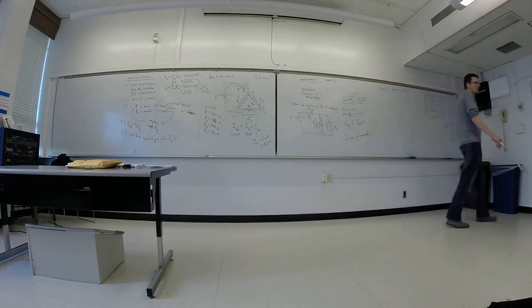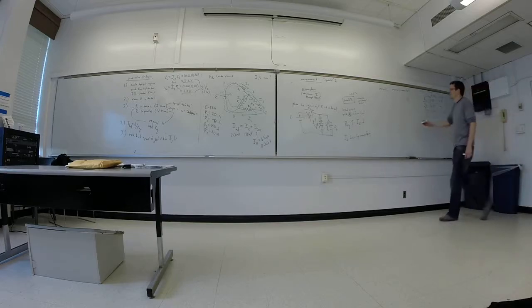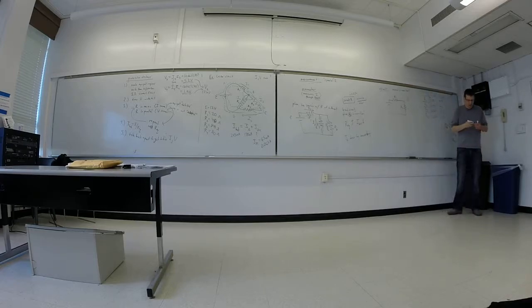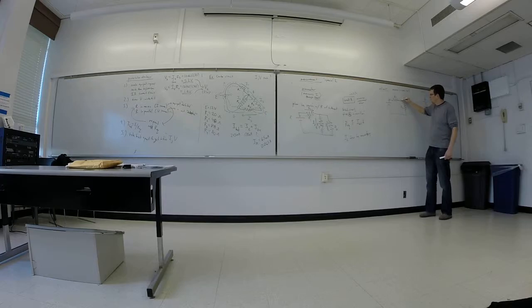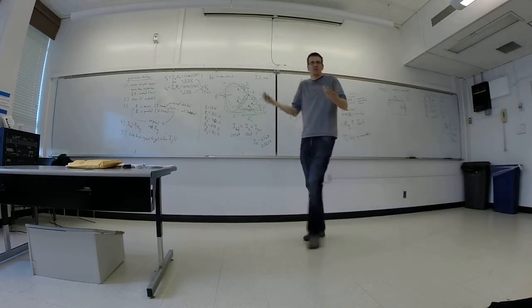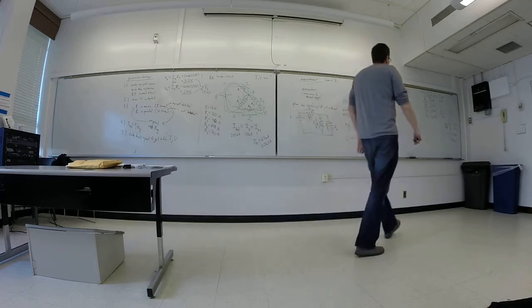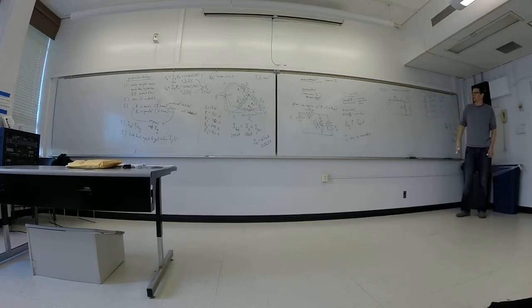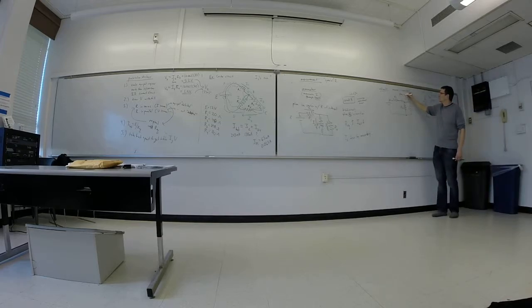And there you're going to exploit the property that voltage is the same in parallel, right? So for instance, if I go over here, I have my R1, let's say R2. I label my equipotential regions A, B, and C. So let's say I wanted to know, I don't know why I keep on picking resistor 2, but let's say resistor 2 is what I like. I want to know what's going on with resistor 2. So basically that means I want to know what is the voltage drop across this one, what is the voltage difference between B and C. So what I do is I connect a voltmeter between regions B and C. Looks like this. So I want to place it in parallel with the resistor of interest.